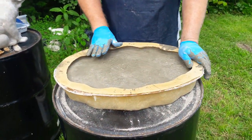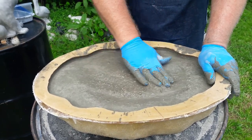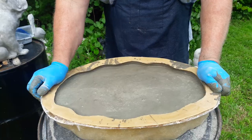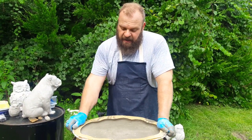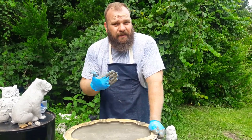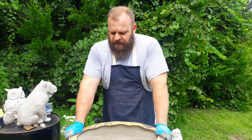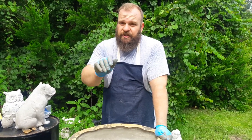There you go — that is just your standard cement mixture: Portland cement, gravel, sand, and enough water to get this consistency. This is pretty much the same consistency I use on just about everything. If I'm doing really small intricate stuff I might make it a tiny bit thinner, but that's about it. This is my preferred mix — there are other people that do it differently, but this is what we've used for years and have the best success with. Remember to subscribe, check out my website RubberMoldMan.com, and hope to see you soon. Bye!